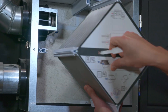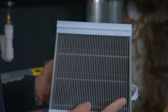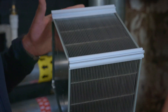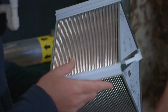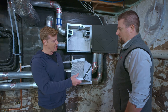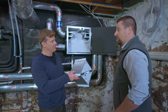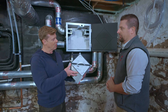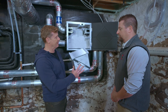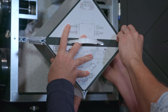Walk me through how these work. This is the core where the air passes through, and you can see it's a metal core. I've seen these before — our guy Richard has shown me a bunch — and I've always seen them with a soft fabric, not fins. Is that the difference? That is the difference. The fabric will transfer humidity and moisture; this metal core does not. So only temperature is actually exchanged through those cores.